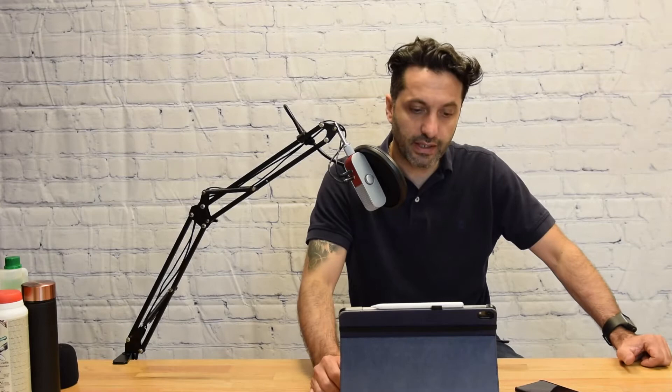Hi everybody, today we're going to go through the installation process of the Sanremo ZOE espresso machine. The prerequisites to connect it are: make sure it's connected to the water, to the power, to the drain connection, the filter is being purged, the pump is pushing at the right pressure, and then once the machine is on we're going to purge the groups and check the output of water coming from the groups.